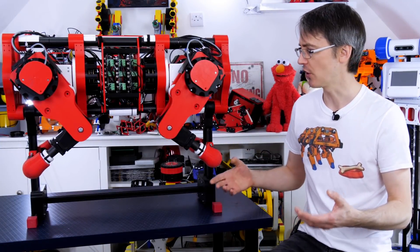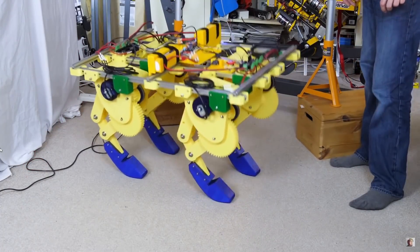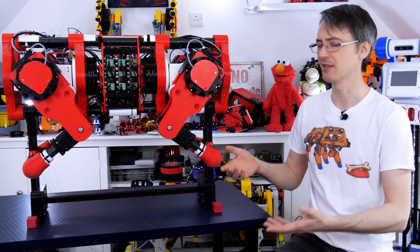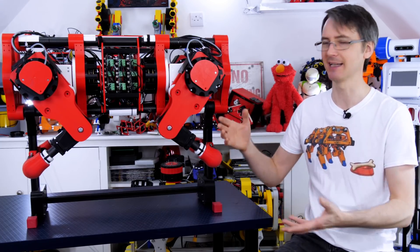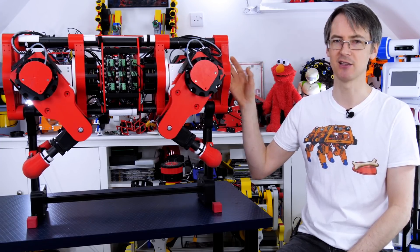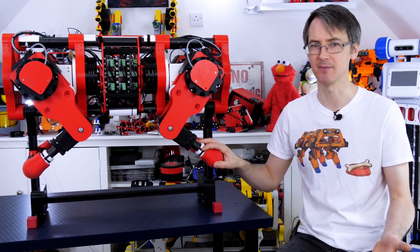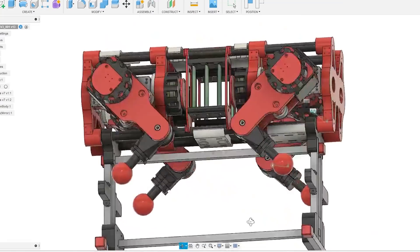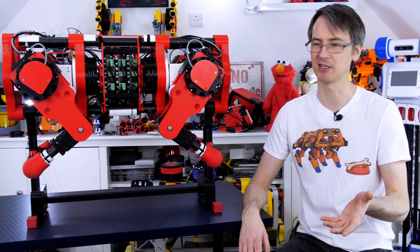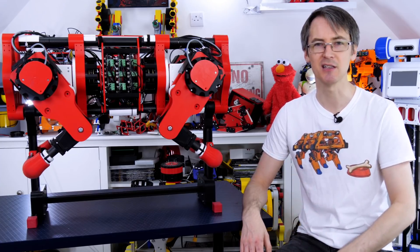I think that's probably the best I'm going to get out of OpenDog 3. I was going to do some work with force control joints, which I did R&D on in the past and there's a playlist on my YouTube channel with those experiments, but with this inherent offset and the mechanical design it's pretty hard to take advantage of force control joints that can feel the ground — I can't walk any more slowly or balance on two legs because the mechanics aren't there. I don't really want to build OpenDog 4, but if I did I'd go for a higher torque reduction and offset the joint with a belt or belt reductions and cycloidal drives so that joint is directly above the leg as it was in OpenDog 2 — we'd probably have a lot more luck there with force control and dynamic stability. I have published the CAD and code; it isn't a beginner's project. If you want to build one, start with one leg, get two motors and one O-Drive, and get your head around positioning those motors with the encoders. The kinematic model code is the same for every leg — just comment out the lines for the other O-Drives and you can still test whether you fancy spending the money on the whole thing.